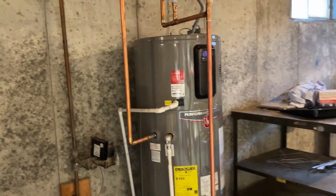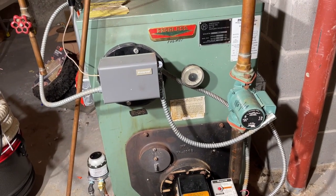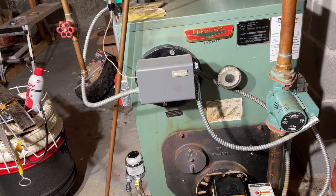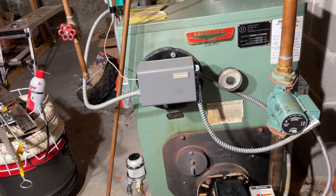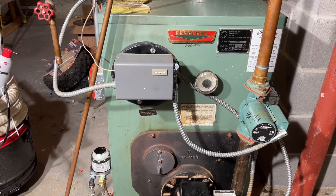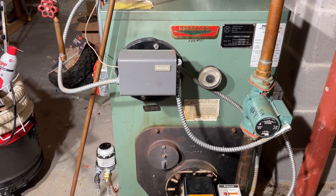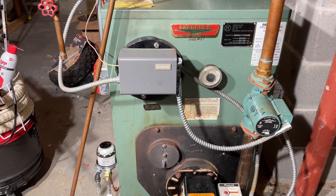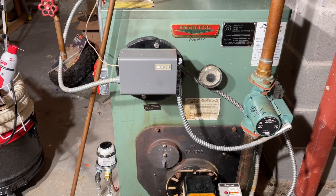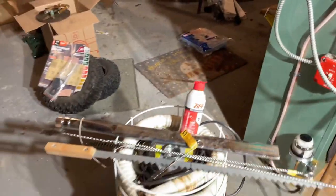You can actually hear the buzzing going right now — the fan's going on that thing. But if you don't clean these down before summertime when you shut them down, the tank inside that holds water will condensate, and then the soot that's on the heat exchanger will harden up and become like a cement. So you really want to clean it down if you're ever going to shut it down.